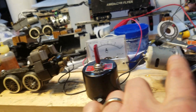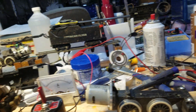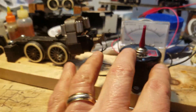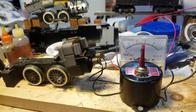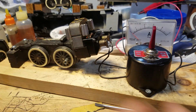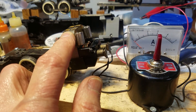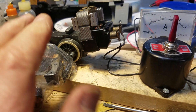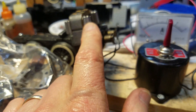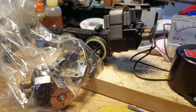The gear noise is just the way this one runs — there are others that are smoother. The point is, the same AC current coming in is rectified underneath this cap. There's a rectifier that takes AC, chops off the bottom, and turns it into direct current, sending that direct voltage out to both of these motors, and they both run the same. I think I'm going to make an experiment of an old-style AC motor and see if I can convert it to DC. Would that be fun? Let's see what happens.